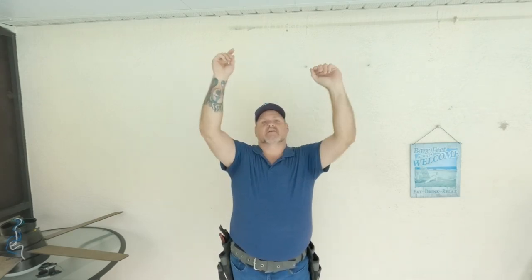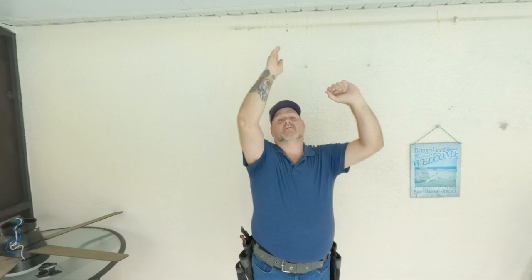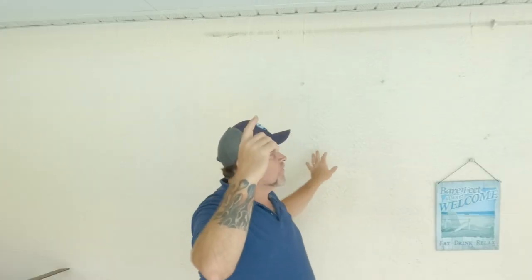The fan beam is exactly in the middle of the panel, running the full length. All we need to do is drill into the end of it, then figure out how far from the wall we want to go — in this case, five feet. We're going to go five feet, drill a one-inch hole so we can get a finger in there to hold the nut, screw in our fan piece, and fish the lines out of the hole to hook up the electric.